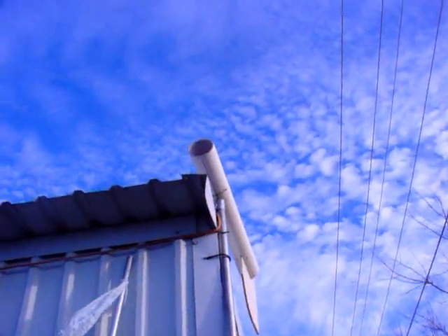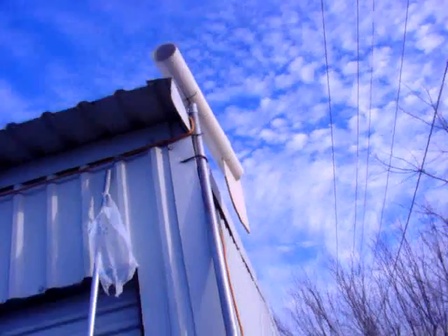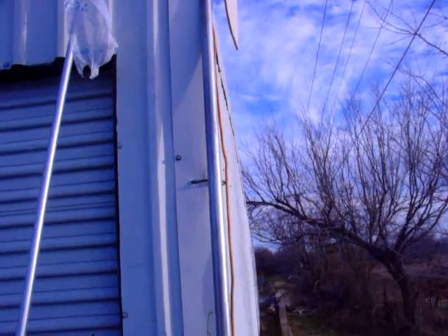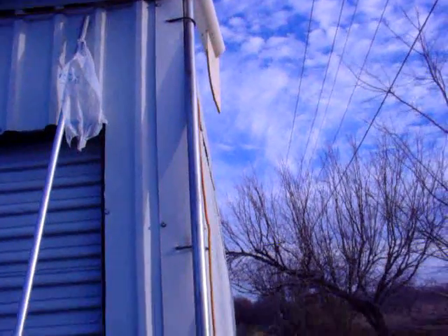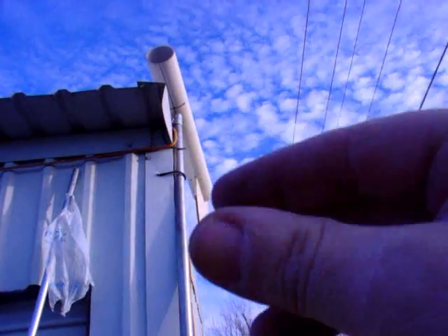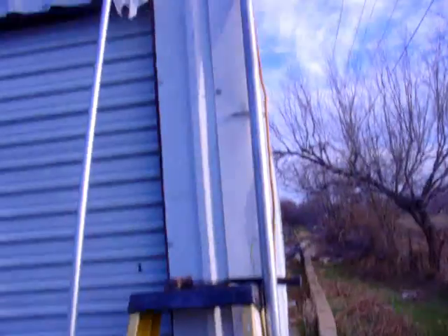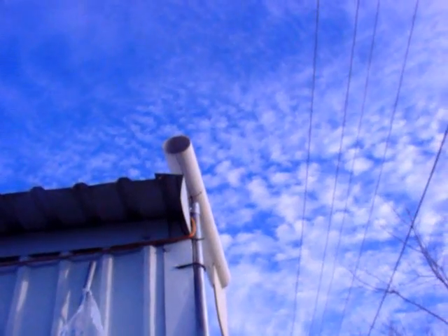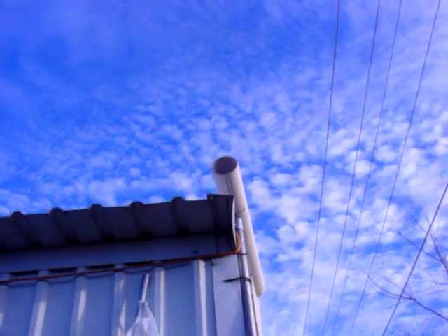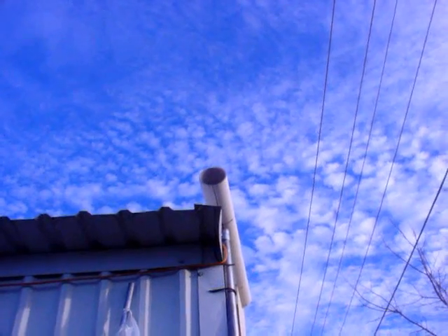Hello, I'm Scott Brown, Green Wind and Other Home Energies, got a little update for you. Where this clamp is right here, I went ahead and tapped the pole upward, then pulled it out of that slot so I can take it sideways, because that one right there has just a little bit of an angle and gets looser as I pull it this way. I lowered it down and when I got it close enough I disconnected the wires. It wasn't windy, there is no wind.